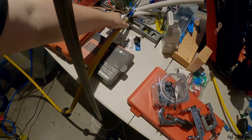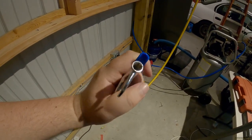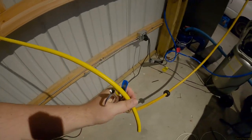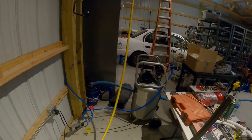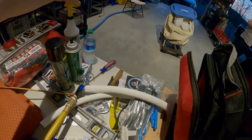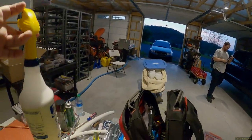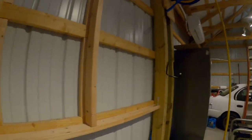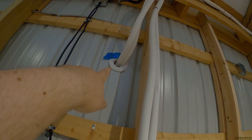And I was holding this as hard as I could to this, to the point where it was not even leaking a little bit. We put like 50 PSI through. And then we spray tested that with soapy water, because of course Zeus has a spray bottle laden with soapy water for killing bees or cleaning windshields. And it's not here, it's the one where you had to recrimp after we messed it up. So we have to fix it and hopefully it won't leak again and we'll do the test again in a bubble.